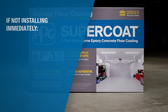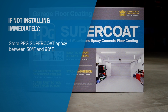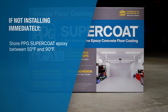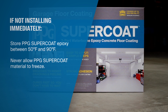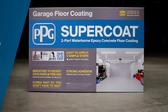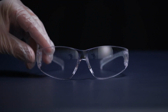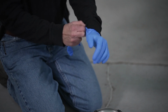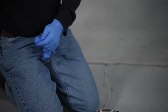If you plan on a later installation, store the kit at temperatures between 50 and 90 degrees Fahrenheit, with relative humidity at 80% or less. Product materials should never be allowed to freeze, and installation areas must be above temperatures of 65 degrees Fahrenheit with proper ventilation. Be sure to wear safety glasses, protective clothing, and rubber gloves for the duration of the prep and application of all PPG SUPERCOAT systems.